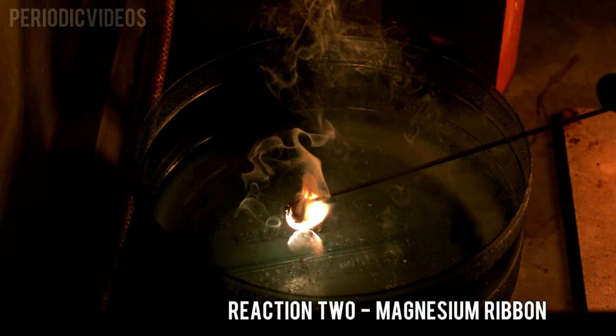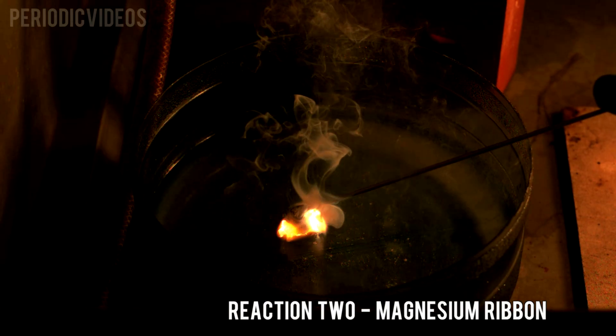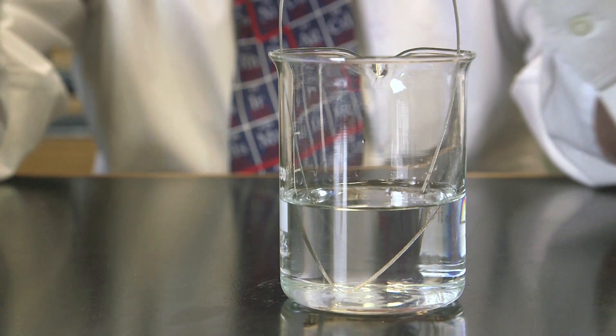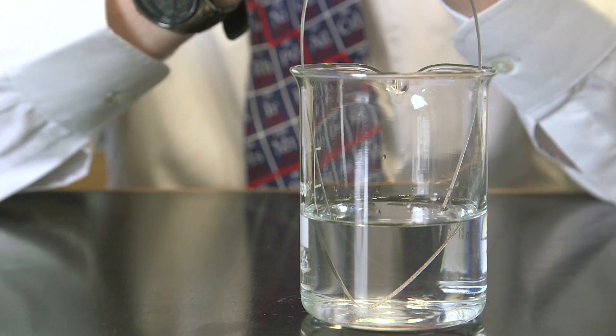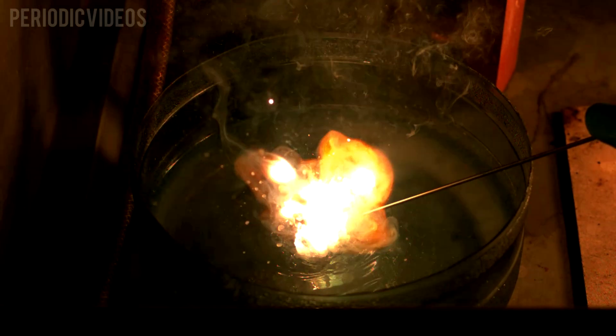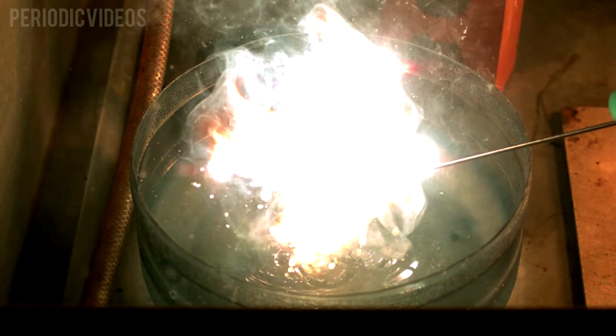When it goes into the water you have a very clean surface of magnesium, and so there is no oxide layer to protect the magnesium — as there is here where the magnesium is coated in a layer of oxide, insulating it from the water. So you have very high temperature water and clean magnesium, and you can get a reaction of magnesium producing magnesium oxide and hydrogen. It may be magnesium hydroxide, but you will get hydrogen. So you have an exothermic reaction making magnesium oxide or hydroxide, and you're producing hydrogen which itself can burn and could cause a minor explosion.